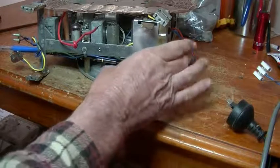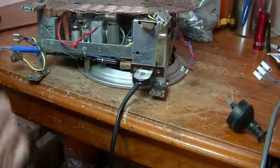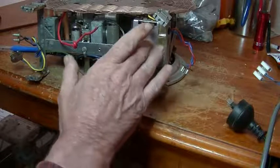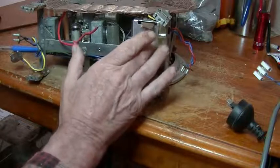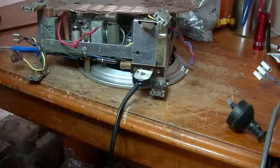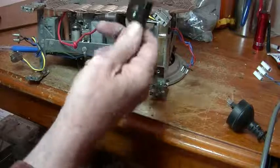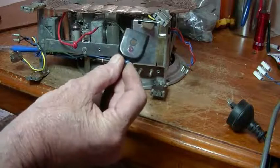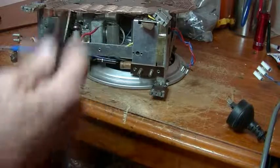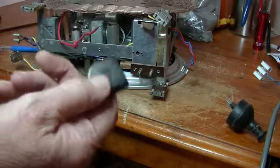Current runs through the chassis and back through the circuitry and back to the transformer. If that was incorrect, I would have 240 volts directly on the chassis. You touch it and you're going to get zapped. So how can we tell which way is right? One plug end has a green dot, one has a red dot — this came from another hot chassis I did repair. Green is clean, red is dead.